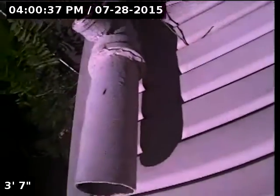Today we're at property address 1804 Southeast Spokane Street here in Portland, Oregon. We're located on the rooftop where there's a 4-inch cast iron vent. This will be the point of access. I'm going to insert the camera and check the overall condition and serviceability of the sanitary sewer line.